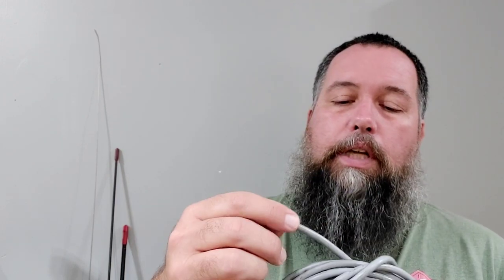Now that you've got your radio, you need to run coax. This right here is 18 feet of what's called RG8X. It is very good starter coax. It does handle a lot of power — somewhere around the 500-watt range is where you want to start stepping your coax up. It is shielded copper, and this stuff is rated at 95% shielding efficiency — that's actually written right on the coax.